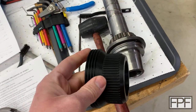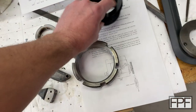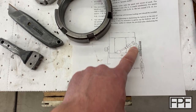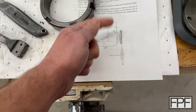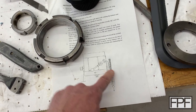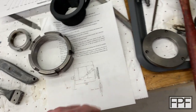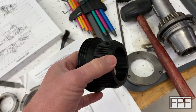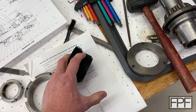Now if we go too small we're going to get some strange things happening with friction of the string, because if that's not clear — you're wrapping a string around this drum or face plate and then pulling from this side with a scale in between, so as we pull it unravels the string and gives us a measurement. If we go too small there's going to be weird stuff with friction of the string touching the next wind. But here's what I'm thinking: what if I could take this design and essentially build onto it a drum that is exactly two inches in diameter?